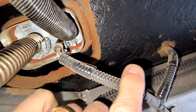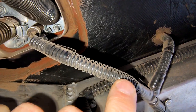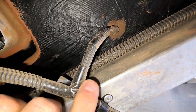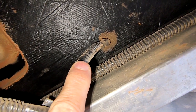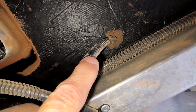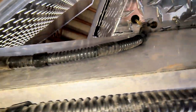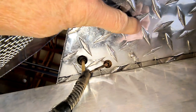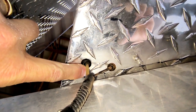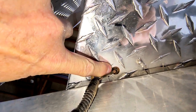So let's follow the fuel line. The fuel line is here and it's got protective flexible conduit over the top of it, and it runs this way. This is the power feed that goes up to the heater and to the electronic controller — the brain — up on the wall, and then it runs along the bottom of the trailer and comes up. This is the box on the tongue of the trailer we looked at earlier in the video — this is where the fuel line goes through, and this is the power line that goes to the little diesel pump inside there.